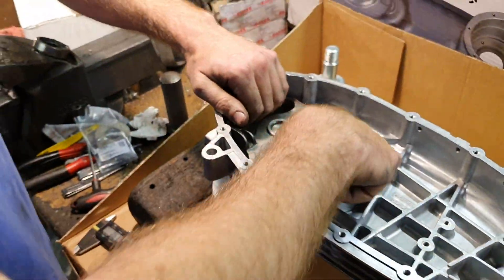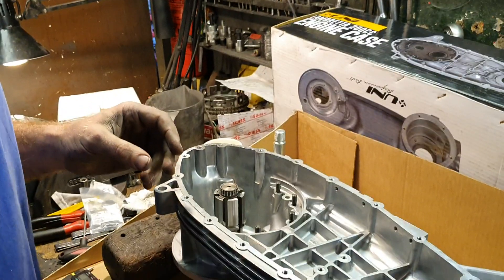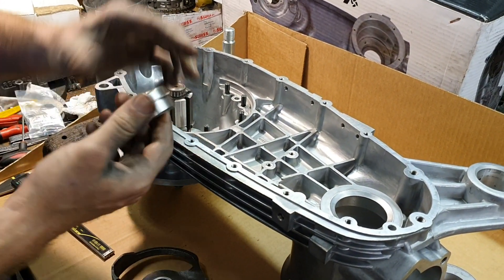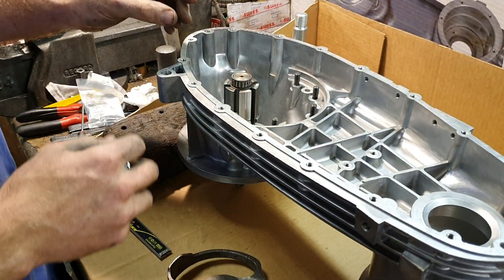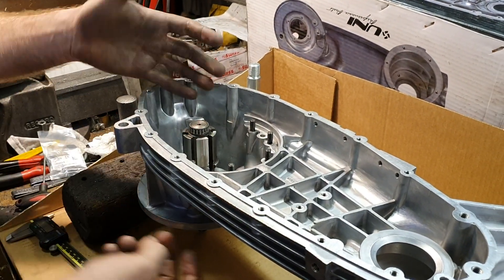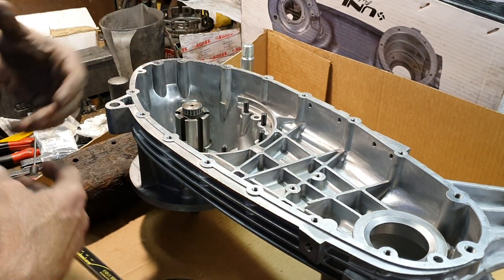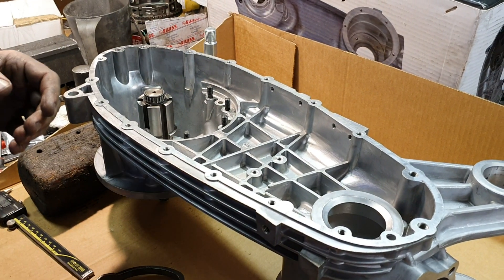Now we can do a sales pitch on our rear hub bearing here. The double roller rear hub bearings are remarkably rigid because they've got two sets of rollers in them, which means the layshaft has negligible play, allowing us to be really accurate in our location. With standard rear hub bearings it's far easier not to get this correct, and you can't do it with the standard rear hub bearing on the side as the layshaft's own weight will pull it out of position. If they are out of position, you'll just wear out bearings much faster than you should.